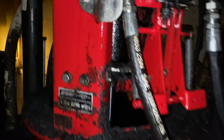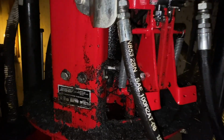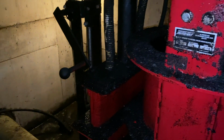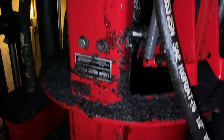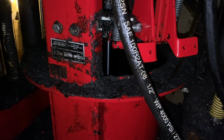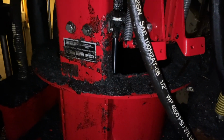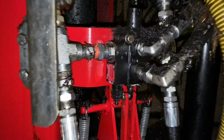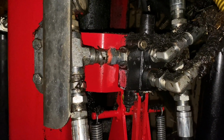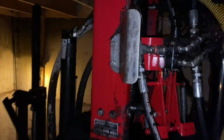The manure comes into this hopper there, goes down in, and this big piston pump is basically like a plunger. So it plunges up, and it closes that door, opens the door to go out to the manure pit, pushes the manure out, the door on the left closes, the door on the right opens, and then it sucks the manure back in. And it just keeps doing that continuously. So we definitely need all those connections to hold their own. And it looks like they are. So we're in good shape.